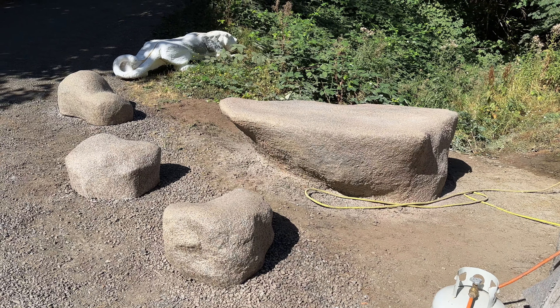That's got it stained. I'm going to let that dry, take a lunch, wait till the shade comes in, and then spray it with a 100% acrylic carried in a xylene-based solvent sealer that lasts five years. I'll give it two to three good coats — it'll have a little sheen for about two weeks and then it'll die down. That's the color I was after: a lighter tannish color. The panther is going to be black and shiny so it'll have a good contrast. Thanks for watching!